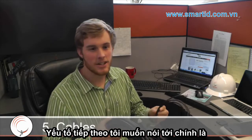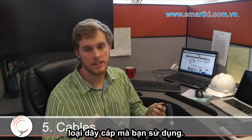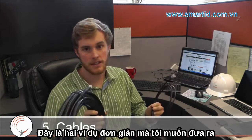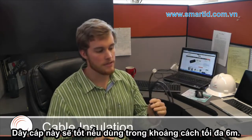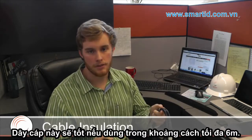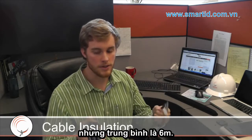All right, the next thing I want to talk about that affects your read range is the type of cable that you're using to connect your reader to your antenna. And these are two basic examples that I brought to show you the difference. This cable would be great for anything up to the point of about 20 feet, plus or minus. We always recommend testing, but that's a good rough estimate, about 20 feet.